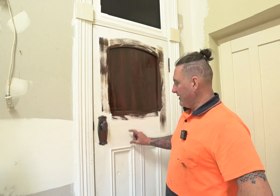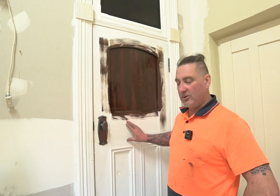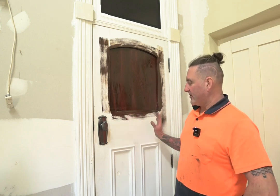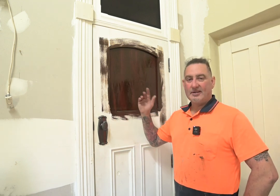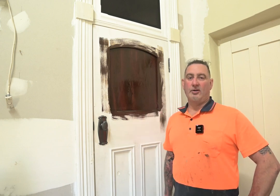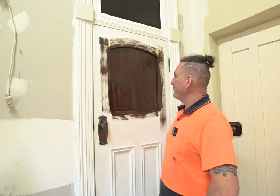So you probably want to always do the wood grain pattern somewhere in the middle, but offset it a little bit. Maybe do two small ones. Do one panel all dark. Do one panel all light. Mix it up. That's the trick. Mix it up and no one will know, because timber is totally random. You know, each tree is different.